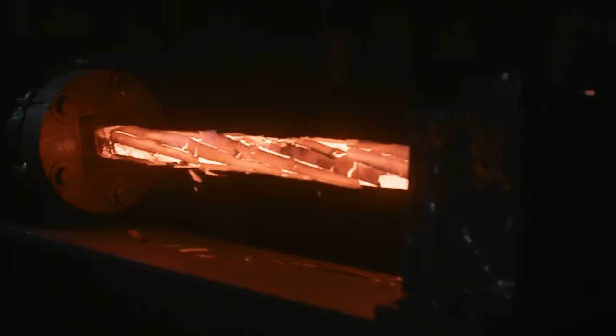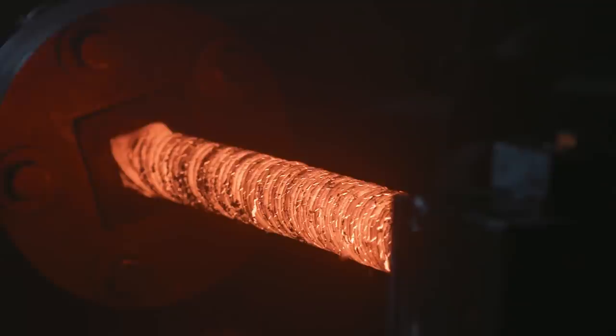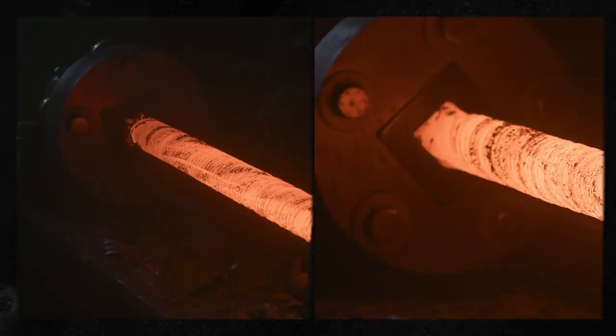The billets are now loaded into Rob Deckelbaum's Screwcifier. This machine has a 2-horsepower motor, but it has a 76-to-1 multiplier in the reduction. I'm just absolutely amazed at how smoothly this works. Of course, these two blades are opposite on a single sword. We're going to have to make sure that the left one twists to the left and the right one twists to the right.